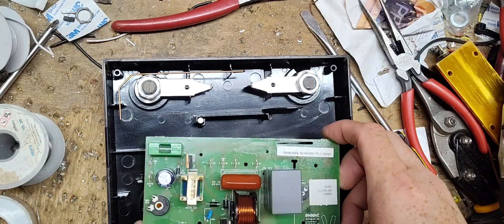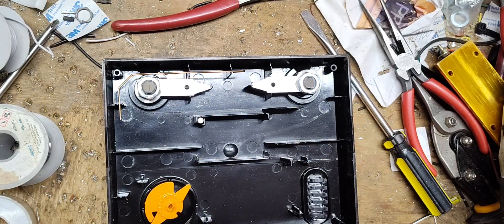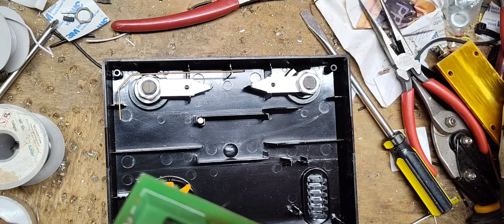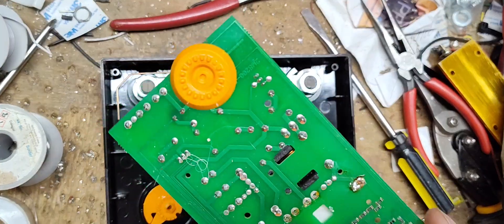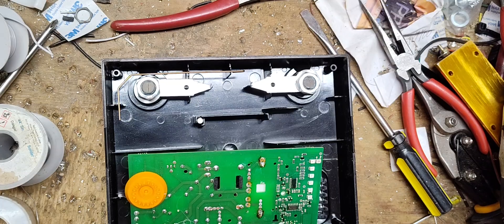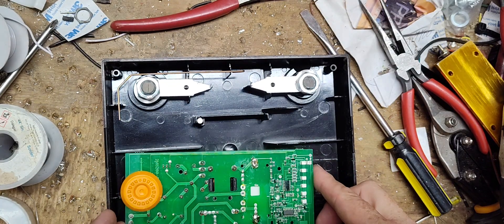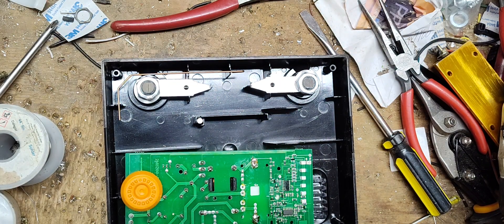Before, it was only flashing and clicking with just the bottom red light on. I thought maybe the transformer possibly had an internal short. I put a new board in that I had and that solved it — all the lights were flashing and it was putting out good power. So now I'm going to try a new capacitor first and hope that's what solves the issue, but I can't guarantee it's going to fix it.